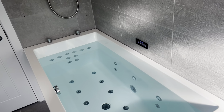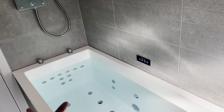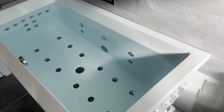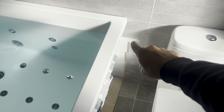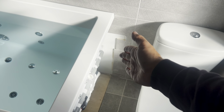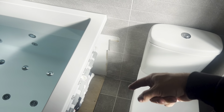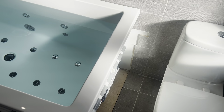The rest of it's been taken care of. So when you've only got one outlet in your new build, you've already got a thermostatic mixer underneath more than likely, so you can use the existing pipework without having to reinvent the wheel. Then it's just a case of replacing the 2 tiles to keep the distance to go fully across. That's easy, accessible because the team is still on site, or if not, you can easily get a match on newer tiles because they're not usually unique from my experience.